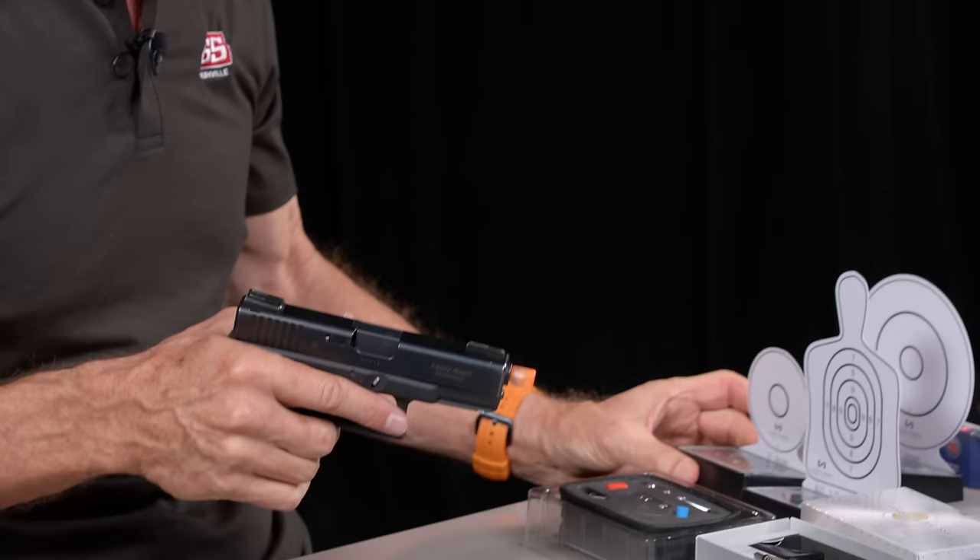On this particular firing pin for the reset striker, it does not have that safety feature because you can't fire live ammunition with it. The safety plunger has to come out, because this longer striker sits down farther and doesn't have the cutouts for the safety plunger — it will not go in. If I try to put it in right now, it's going to get to about here and stop. You can see that it's starting to intersect with it.